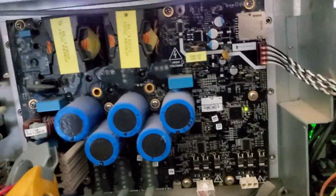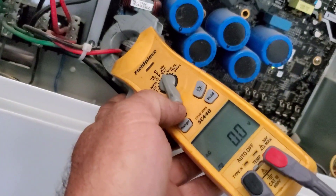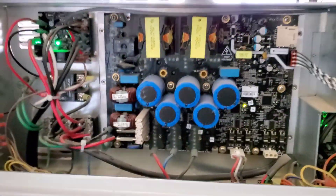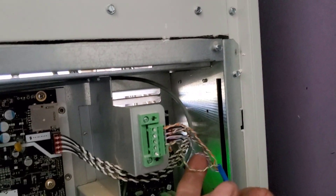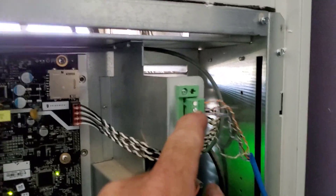I've worked on Mitsubishis and other stuff — they usually have the full wave rectifiers on there. 6.3 amps. So fully variable speed. Thermostat connections right here on these — they have power like 12 volts DC and then two terminals for communication, and it communicates two ways to the thermostat.